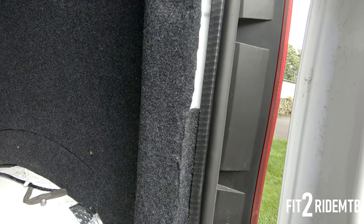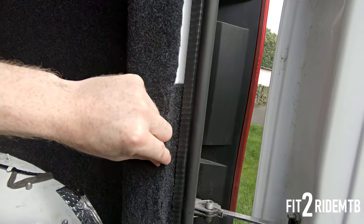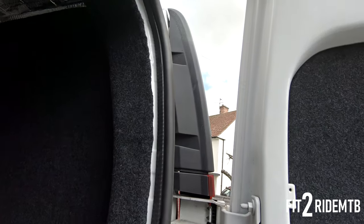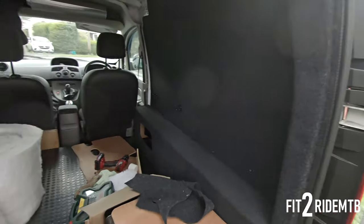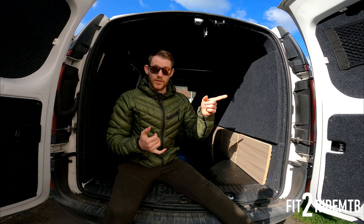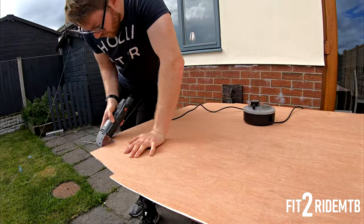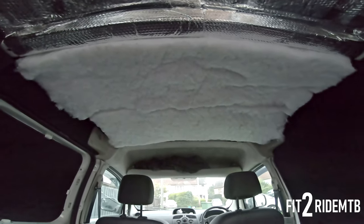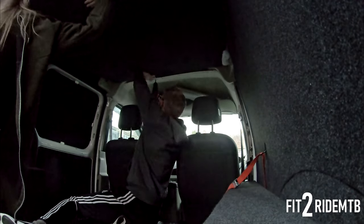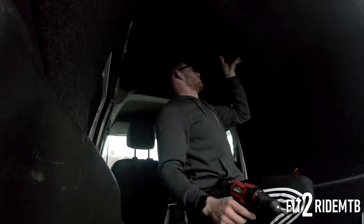Once you cut straight down over both pieces you'll be able to join them up and pinch them together. If you get a little brush you can actually blend those — that's a way to fix the mistake if you're trying to get it nice and neat to the edge. I ended up carpeting everything that was ply, from the doors to the side walls. I also did the roof, cutting it out, measuring it, and carpeting that as well. For the roof I insulated the top, putting the loft insulation up in between the ply lining and the ceiling, and then obviously put the ceiling in — that was kind of a two-man job.